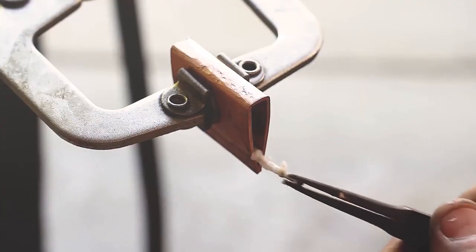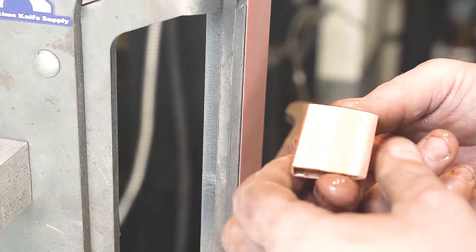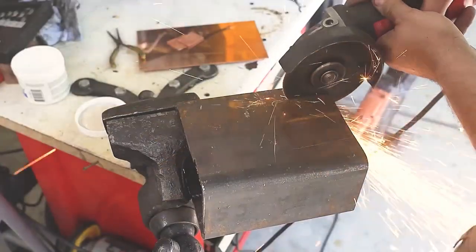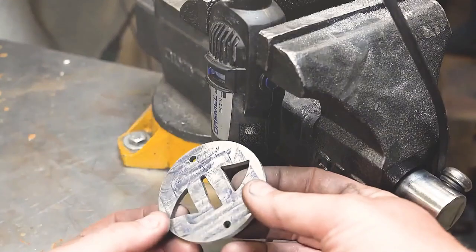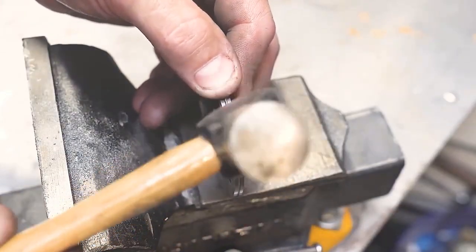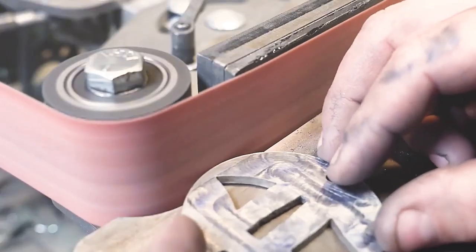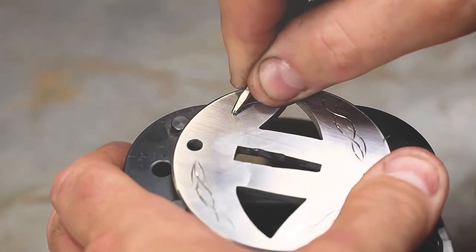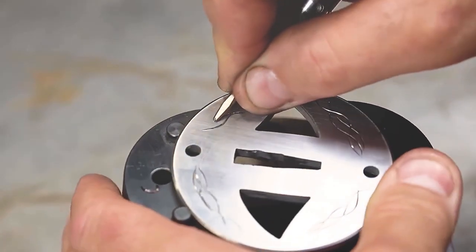After making the mold, a silver bar was inserted, which was heated repeatedly, and when the silver melted away it filled the gap without affecting the appearance. Lao intended to use soft steel as the material for the knife shape, and engraved a pattern for finishing. Once the shape was finished, Lao cut a groove in the side of the knife shape and built in a copper wire for decoration. The knife-crafting is quite meticulous. In order to make the sword shape not monotonous, Lao also carved a wave pattern.